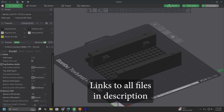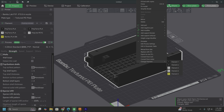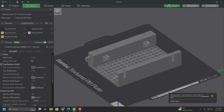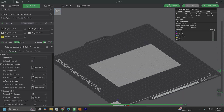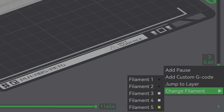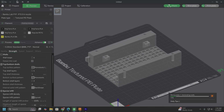There are three parts you're going to have to adjust some of your print settings for: the midsection and the left and right sections. This is pretty easy — we're just going to right-click, hit change filament, change that to a white filament, and hit slice. Once it's done slicing, drag the slider all the way down until we get to layer number three. At layer three, right-click, click change filament, change it to a black filament, and hit slice plate once more. We now have our white and black filament changes.